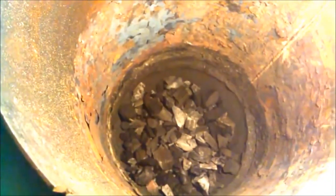Okay folks, here I am again. There is a load of charcoal in the gasifier. I have the Bunsen burner flare ready, the blower is on, and I have something like 30 millibar under pressure. Temperature is zero at the output. Let's do it.